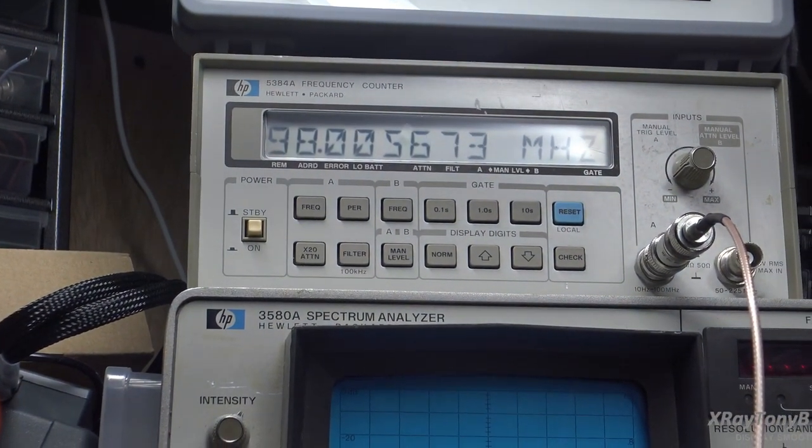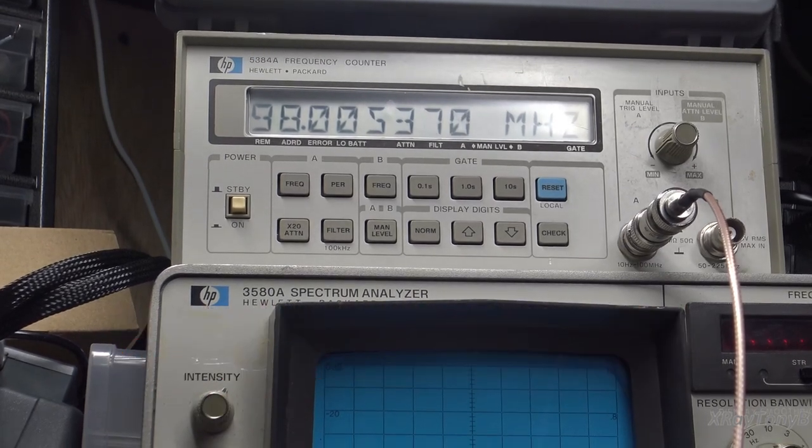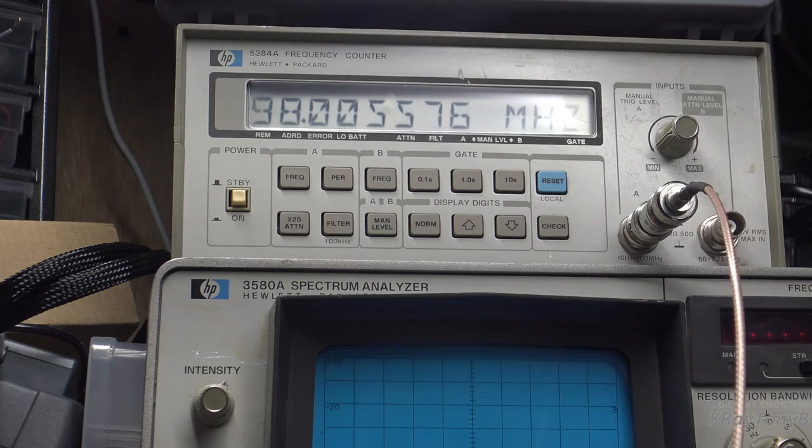If you set your frequency incorrectly, you're going to align your tuner incorrectly ever so slightly. And it's death by a thousand cuts — each alignment that's off by the slightest amount all adds up to being out a big amount. So if you have a frequency counter, I recommend setting your frequencies with it on these analog devices so you know you're pretty close. Even this, you're off by five kilohertz. It's a tuning gang, so moving it a little bit makes it jump a whole lot. That's about as close as we can get it; it'll just kind of bounce around there.